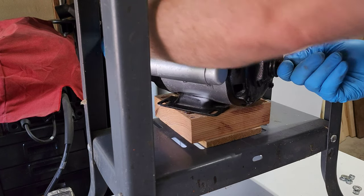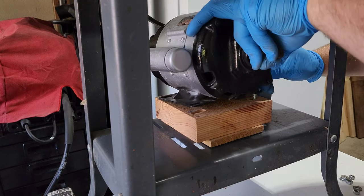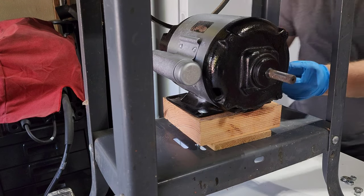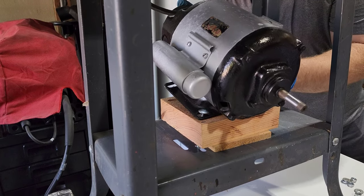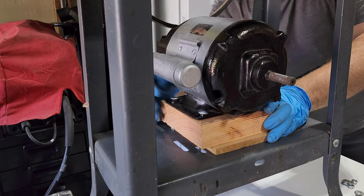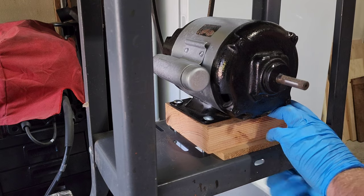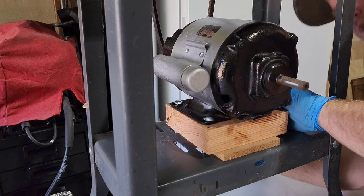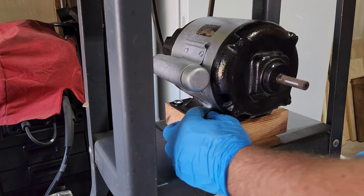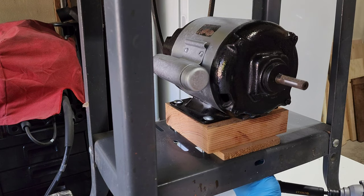I pulled off the old motor — I didn't have the video camera rolling when I did that. I did have to make a different spacer for this and I took it over to the milling machine and milled out the channels for the bolts to go in. You might be wondering why I'm using wood under there to lift that motor up. The simple answer is that's how I got it — it was that way when I bought the machine. I think the reason is people probably didn't have the right size belt back in the day. They just had a belt that was maybe two inches too short, and it is cheaper to grab a piece of scrap wood and use it as a spacer than to go buy a new belt. I see a ton of these machines with these pieces of wood under there.